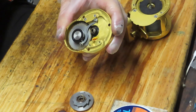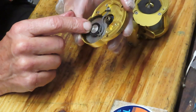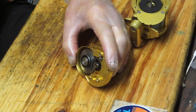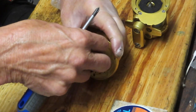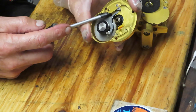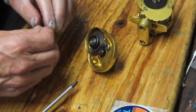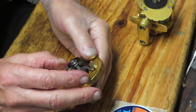Now we have the pressure plate with a bearing on top — there's a bit of dirt on the back. Underneath we have an anti-reverse dog that's run off an eccentric on the main gear, and we have a pinion gear. On the case side we have the anti-reverse dog click ratchet and a fresh plate with a sealed bearing. I'm going to remove the two screws holding that plate in. This is a good place for a picture — the plate can be reversed easily, so note which side has the arc that accommodates the gear, and mark it accordingly.